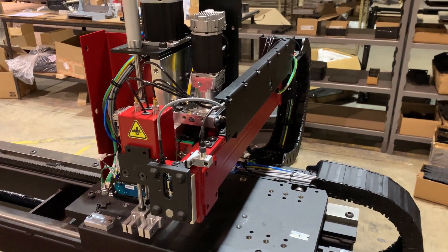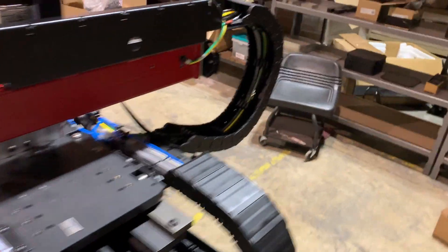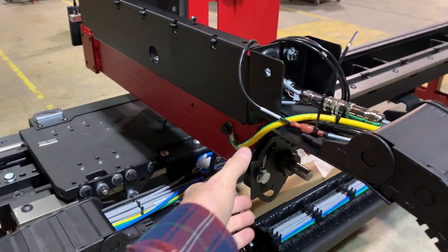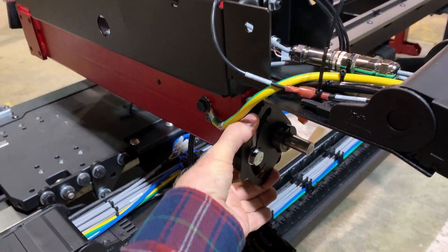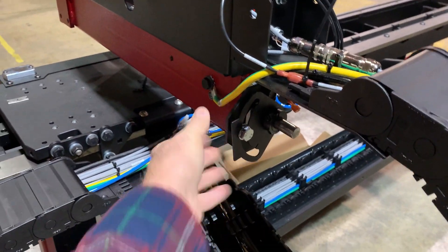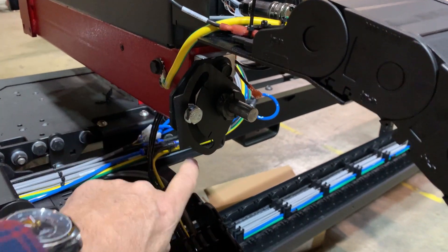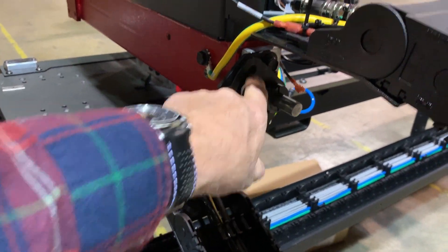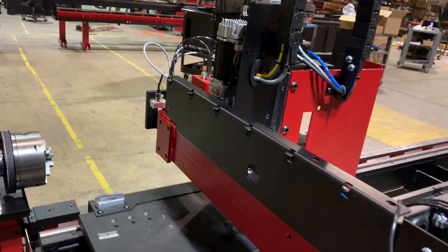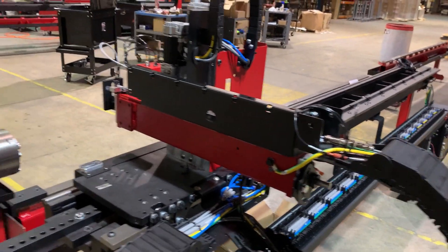This machine is not equipped with the motorized tilt axis system, which can work under program control. This customer really didn't need it, but all of our machines are tilt-head capable. Without the motorized system, this one is fitted with the manual adjustment — you can see the torch steel moving up there. It's a very simple mechanism: you adjust it, you can put a level on it to make sure you're straight. It's also got indicators — the 45-degree and zero indicators right there. You lock it down and then manually adjust the torch, so if you're going to chamfer into the pipe, you've got no problems.